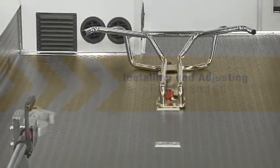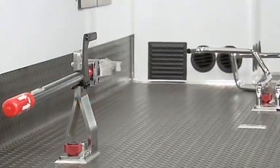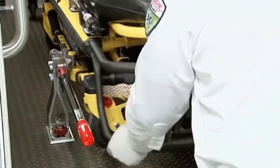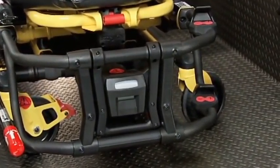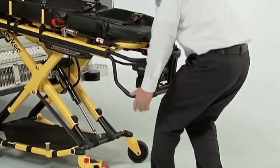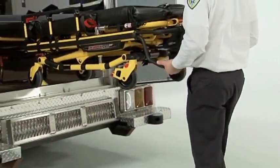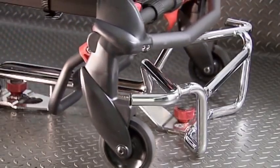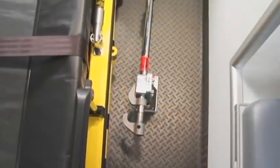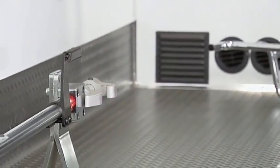The in-fastener shutoff is a safety device that prevents the cot from raising and lowering when locked in the cot fastener. Proper placement is critical. The cot needs to be properly secured in the cot fastener and aligned with the in-fastener shutoff, or the cot may be accidentally activated. To install and adjust the in-fastener shutoff, load the unoccupied cot into the vehicle with the retractable head section fully extended. Push the head section into the antler and push the cot retaining post into the cot fastener rail clamp. The spring-loaded clamp will click as it closes around the post. The rail clamp on the cot fastener can be adjusted if needed.